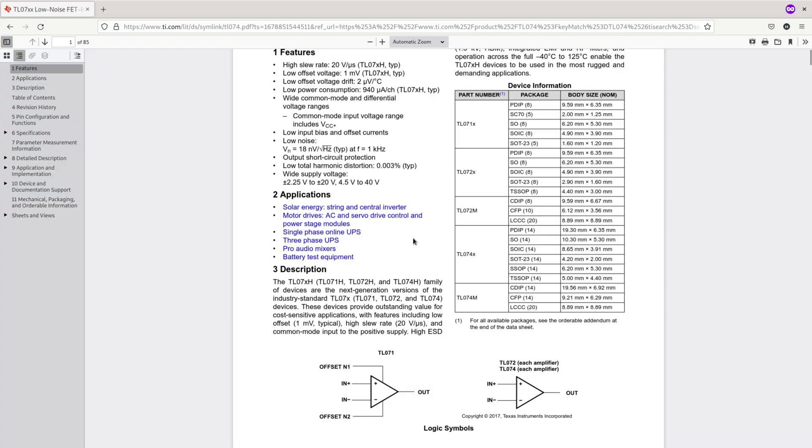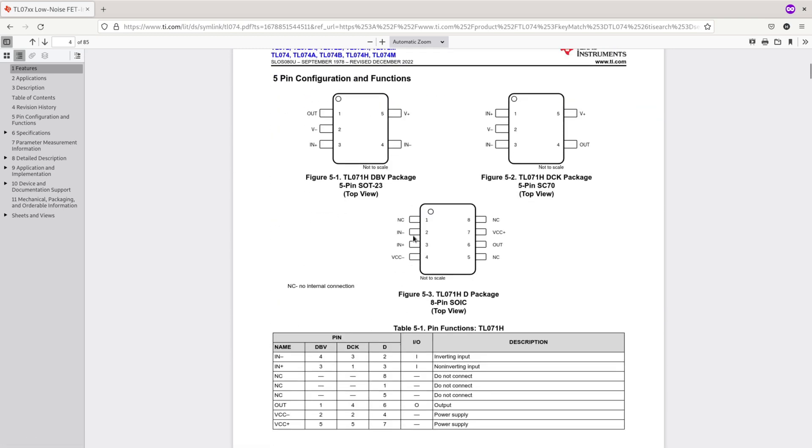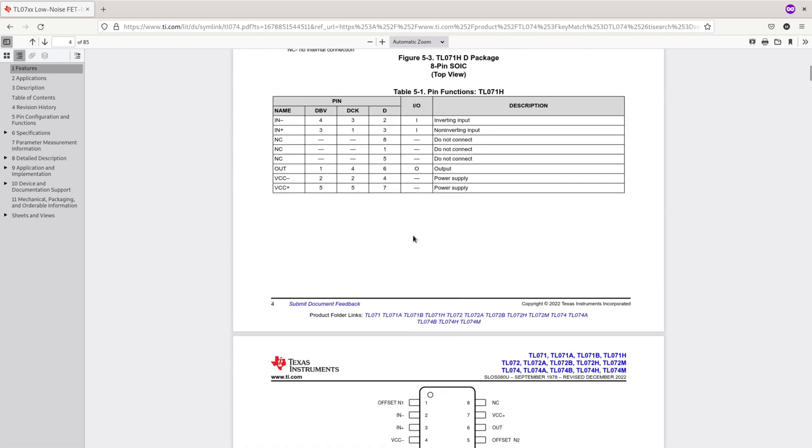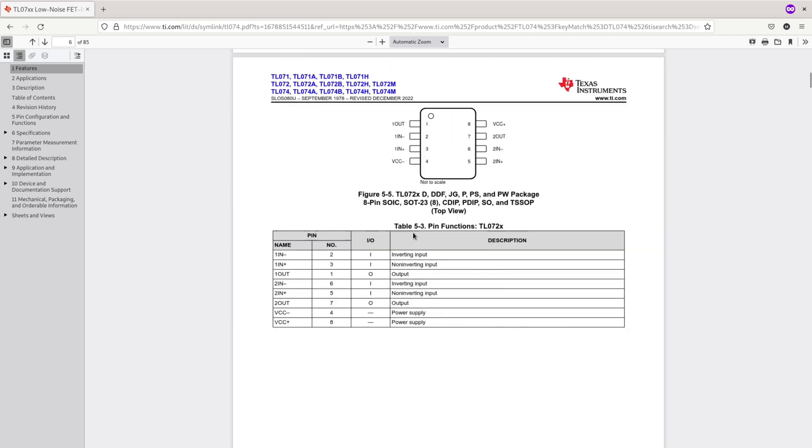There were a couple of issues with my design. Overall the effect works fine — I was able to use it as a reverb and the pots work great. However, the CV input doesn't work. So I went back to my KiCad files to try and figure out why. This is when I realized the importance of double-checking datasheets. A datasheet is basically where a manufacturer describes in detail everything about a part — this includes the pinouts, voltage ratings, sample applications, and many more.